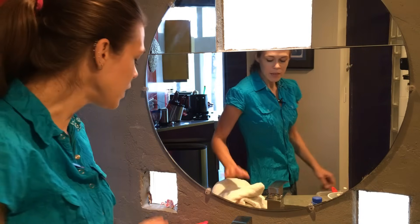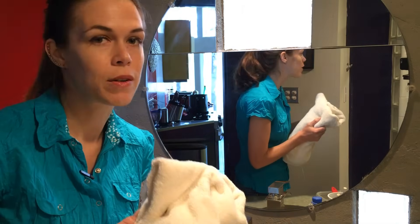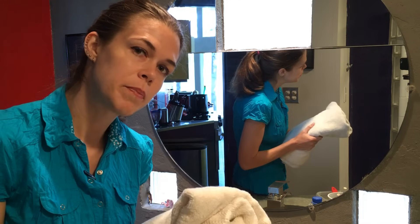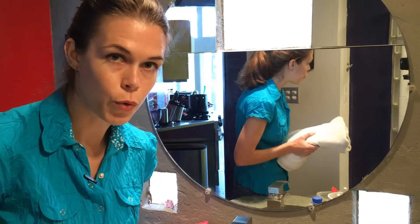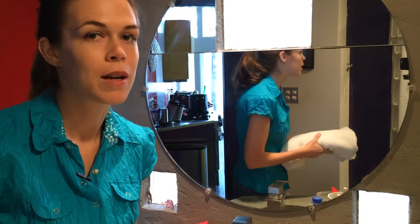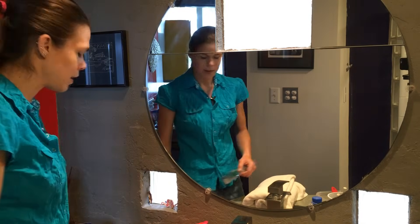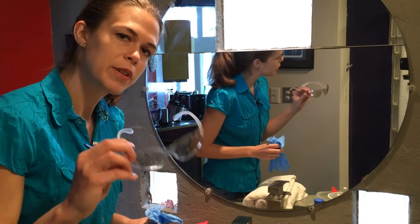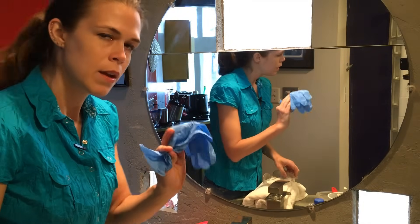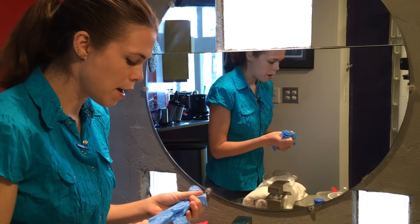You'll want a white towel if your grout is white or light-colored, to wipe up spills and excess sealer after letting it set for a few minutes. If you have dark grout, use a dark towel — you don't want opposite-color lint getting stuck in your sealer and having to look at that for the life of the seal, which could be around 20 years. Since this is not the friendliest product, you'll also want eye protection to guard against splashes.